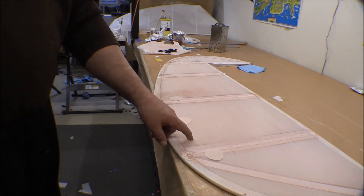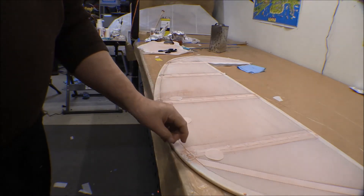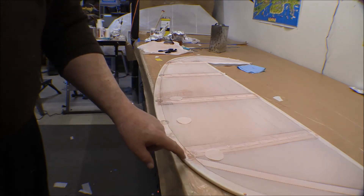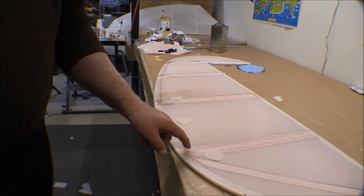This thing sits with the trailing edge down low, so moisture builds up along it. Any moisture that builds up in there — I don't know whether it gets in through the seaplane grommets, maybe — but I decided to put the grommets right here. This rib runs down this way and the intersection is right here between the trailing edge and the rib, so I'll put one seaplane grommet there because moisture will run down this way and hopefully come out that.